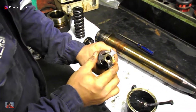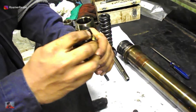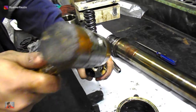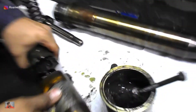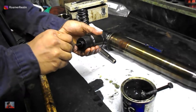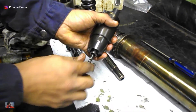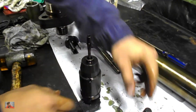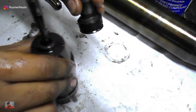After this, insert the thrust piece by hand. It'll only go so far by hand and you'll have to tap it with the mallet so that it sits properly. Once again, check that the cut-off slide is free to move and is not stuck. The fuel nozzle goes next. Remember to check the alignment marks and also align the locating pin with the groove on the fuel nozzle.